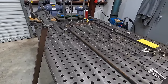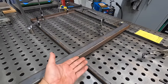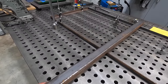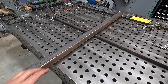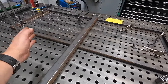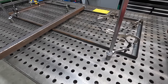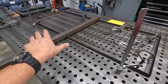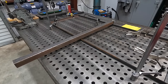Back to the frame — we're going to start getting it fitted and welded together. Here's the two-inch tube that will sit across the bottom, which is what's really going to support the whole cargo carrier. I'm also going to add a couple of outboard supports using about inch-and-a-quarter tubing, one piece on each end, along with a piece of angle iron welded to the bottom of the receiver hitch that these tubes will bolt to. That'll help carry the load and provide side-to-side support.